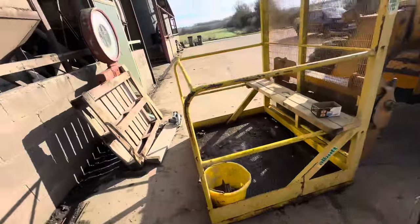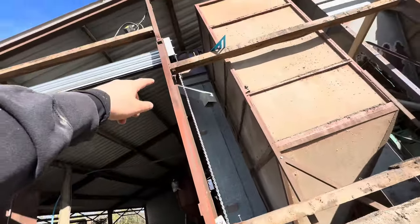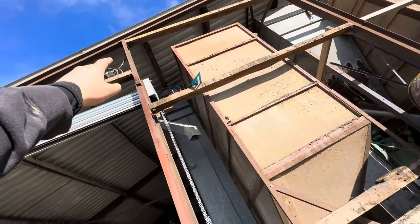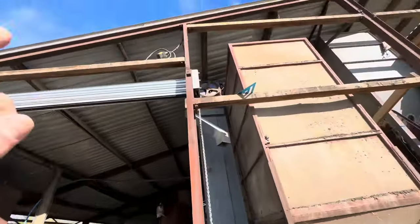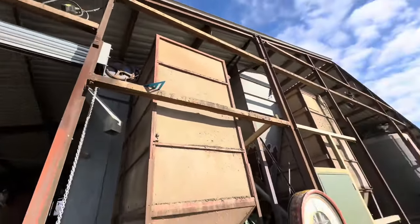Yep. So we're getting set up for it, guys. We're gonna get up there. We're gonna measure from our marks, 10 foot top of timber, mark out for the holes, mag drill the holes, bolt the brackets on, measure up the timber, get Connor and Andy to cut the timber, pass it up, mark the holes, bring it down, they'll drill the holes, put it back up, bolt it on, work our way along. Sounds relatively straightforward.